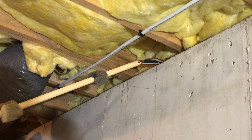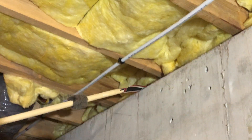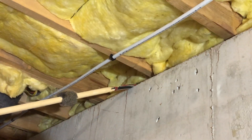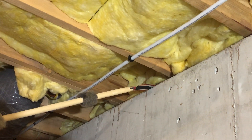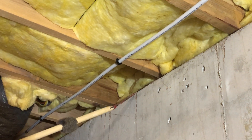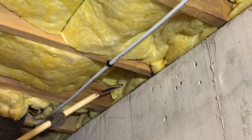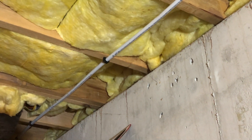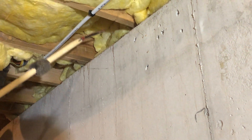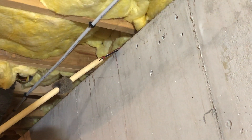Just like in class, we talked about how sill plates are made out of pressure treated lumber, and underneath our sill plate is our termite shield or sill seal, which we use a lot nowadays — something to keep the bugs out. That's a pressure treated piece of lumber because it's sitting on concrete. It's fastened with an anchor bolt down to the concrete — a little J anchor bolt, a threaded bolt that sticks up above the foundation, and the sill plate is fastened to that bolt.